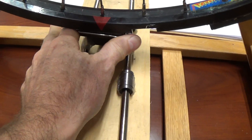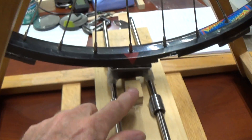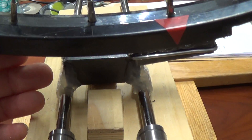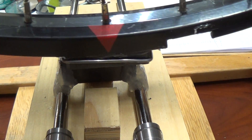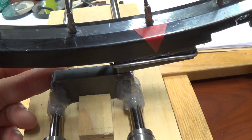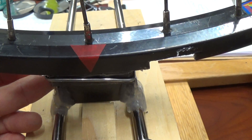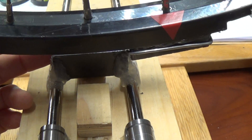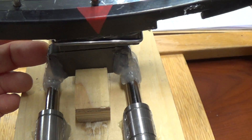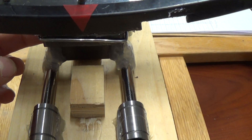I've done a setup here where I've calculated everything. I have a little red marker and a scale on this side which I also slide, and I do the measurements. I measured a complete stroke — there's obviously a little pull force to pull this in. If I lock it in this position you can see it's repelling, so you really want to pull it into this location here, and that's when maximum force is exerted to the other side. At this point it's very feeble, but at maximum position it pushes over.